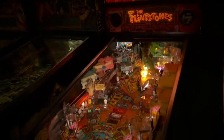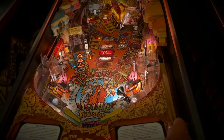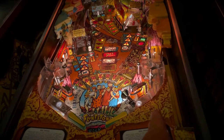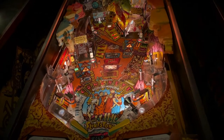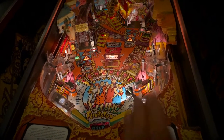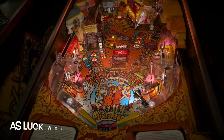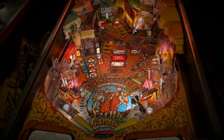All right, well, what happened is I stirred up something after fixing the multiball flipper weakness issue. The ball trough would not see ball number 1 in the trough. It has jam 1, 2, 3, 4. So I took the board off on the trough and reflowed those, and still had a problem. So I swapped ball number 1 with ball number 4. This is the optos I'm talking about. I swapped opto number 4 to ball number 1, and the issue moved to number 4, and number 1 was fine at that point. So I needed an opto for number 4. I went and found a scrounge board, an old parts board, snatched it off, and it works perfect.